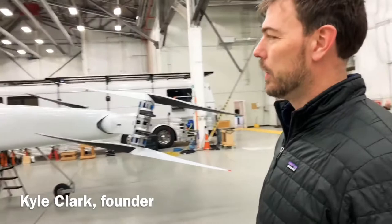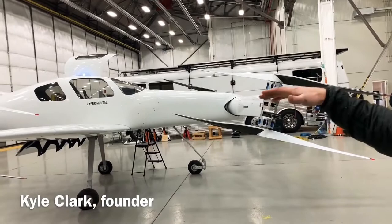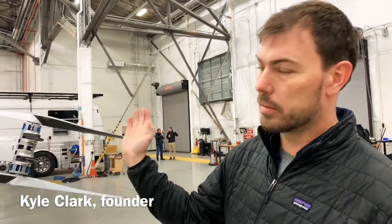This is a 4,000-pound eVTOL aircraft with eight motors and rotors. There are four rotors on top coupled to one battery, and four rotors on the bottom coupled to another battery. They're counter-rotating at each corner, and the aircraft takes off vertically with those nacelles pointed 90 degrees towards the sky. As it rises into the air, those nacelles tilt forward and it starts to accelerate forward.